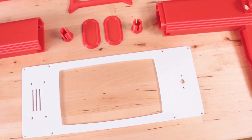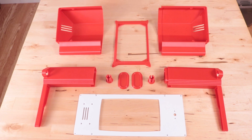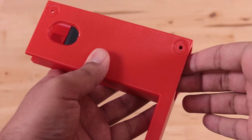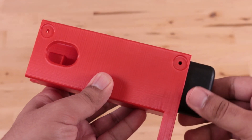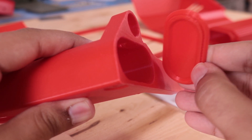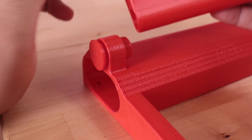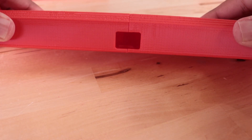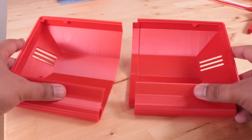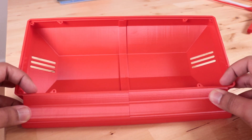Here are the final components. You can see the faceplate and all the other 3D printed pieces — the snap to connect the lower and upper assemblies, as well as the retainer for the LCD. There's a slot for the power bank with a cutout for the USB plug, and a cutout at the base so you can pop the power bank out to recharge it. I've got caps for the ends, pegs for the hinges, a cutout for the wires, vent holes so it isn't entirely sealed, and mounting points for the faceplate.